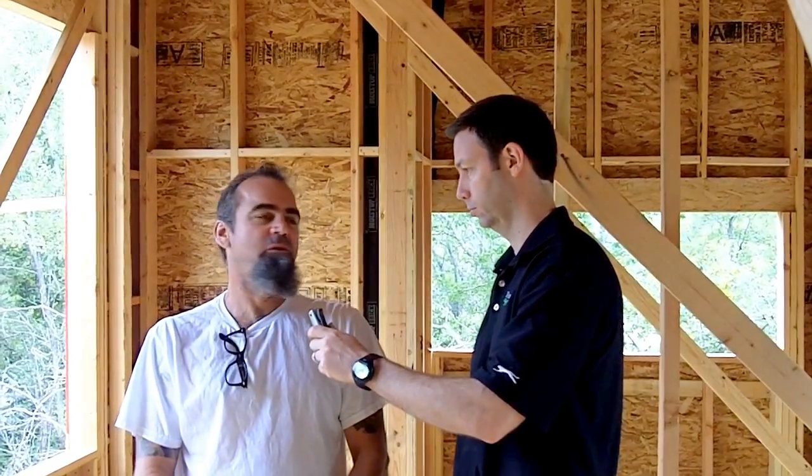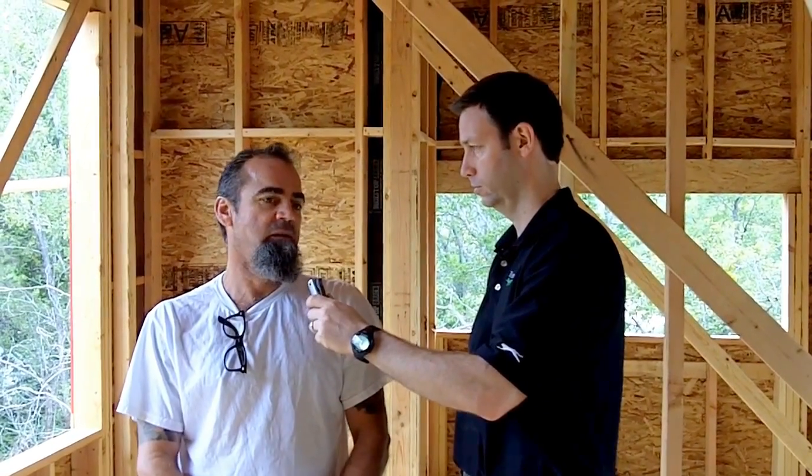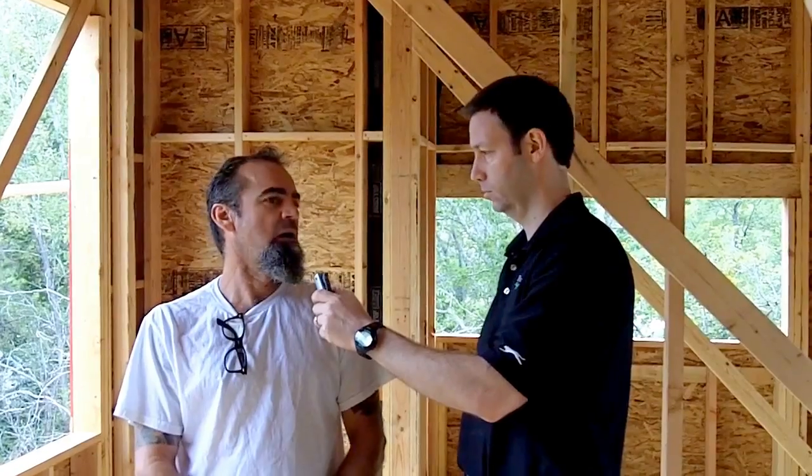Historically, the same thing we've always used for years: dimensional lumber, 2x10s, 2x12s, 2x6s and 8s, with a piece of half inch plywood in between, nailed together, sometimes glued. We've also seen some architects specking out a piece of half inch foam in between them, which tends to work as well, although it makes for a looser header.